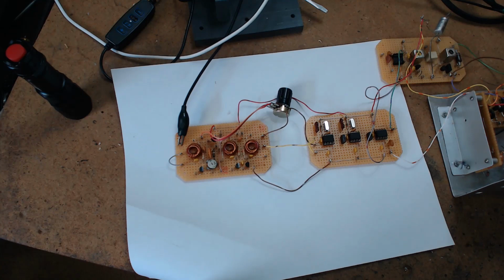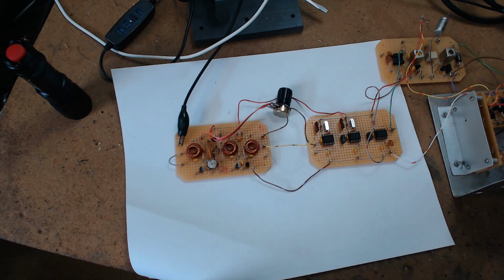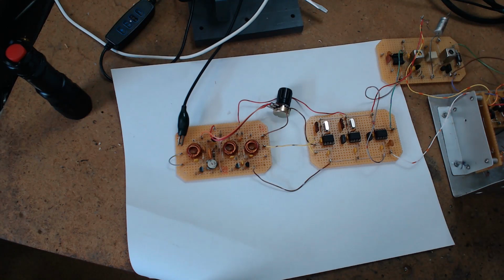And there's so many experiments that I want to run, and I want to read up on toroid coils to find out how much gain, or the Q of these things, how much do they waste compared to a cylinder coil, even the best wave wound with the Litz wire. But I use most of my circuits down here; this one will do 80 to 40 meters. I stay at those frequencies because at night those are the most active, and I do my final experiments just before bedtime. And those are the bands you're going to find stuff on versus during the day. During the day, I have a different set of hobbies.